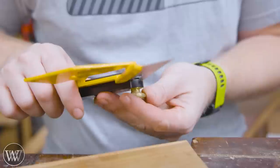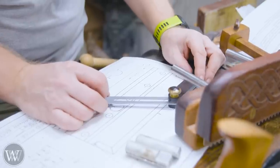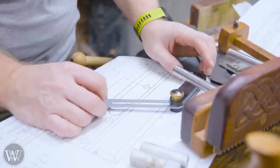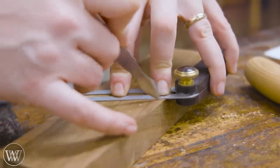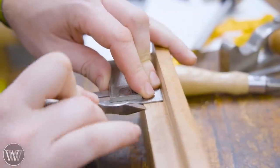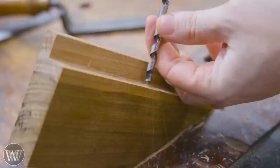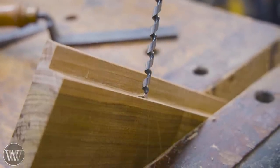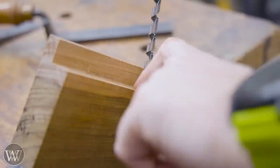This calls for a 50-degree angle, so I brought out my bevel gauge and set it at 50 degrees. The smart thing would have been to set it against the small metal piece that came with the kit, since it's very important it's the exact same angle. Thankfully my measurements were accurate. We're going to lay out those marks on the bottom, and there will be a wedge, so the front angle is actually slightly steeper. We can drill in from one end, then drill in from the other end and chisel back and forth.